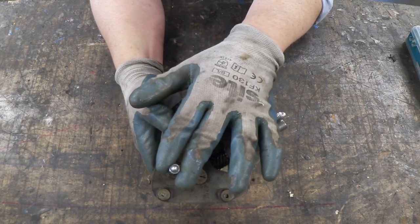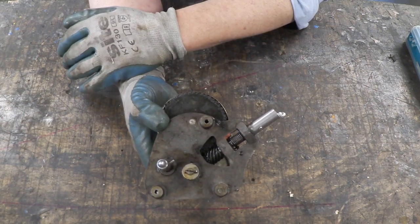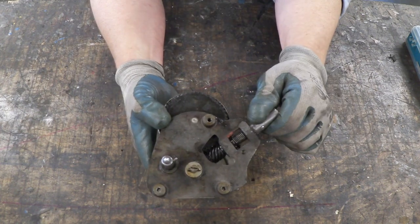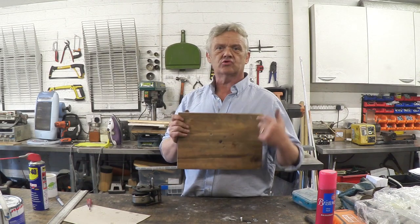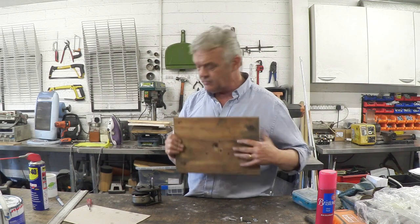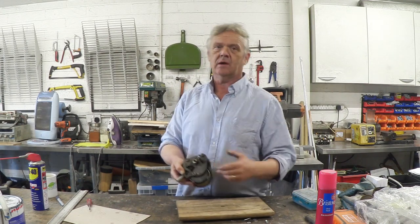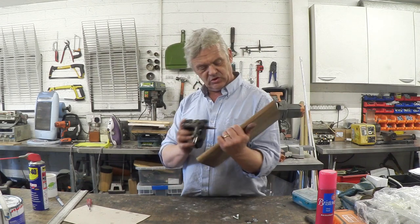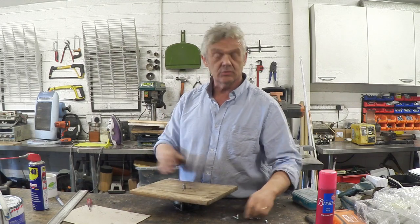I'm thinking of attaching this to some magnets and a coil and making a generator out of it. Of course it's only 78 rpm which is quite low, and it's meant to play records, not actually drive anything, so it's quite easy to stall — we need something low torque. I re-tapped the holes to M5 and got a bit of breadboard, drilled some holes in it so the whole thing can fit, and sunk the board down a bit to clear a raised ledge and a little peg. Now all I've got to do is slot this thing together and pop the screws in.